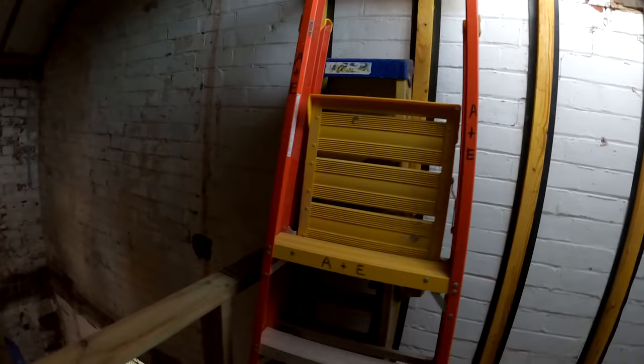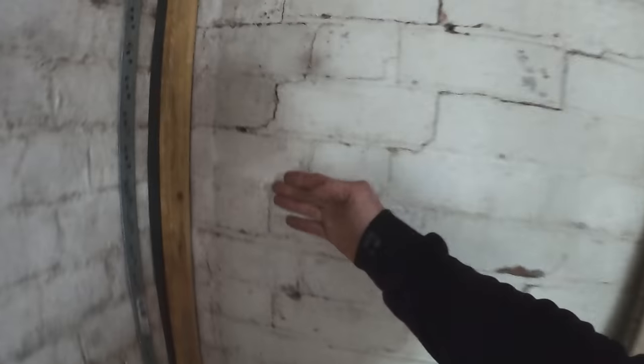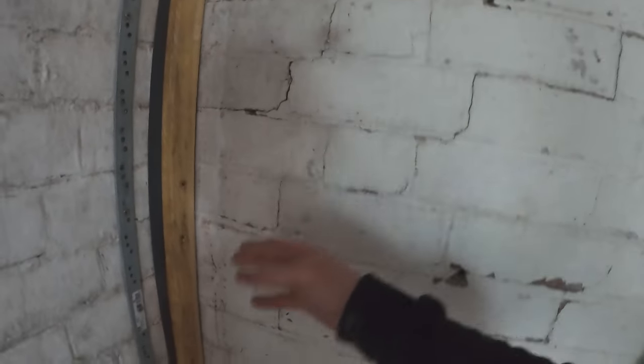And then we can put our foil back insulation board on there. This room's done. We're not gonna do that wall yet. Because we're using those discs, what it's gonna do is actually stand off the wall. By the time we've got our batten and our disc and then our insulated board, it's obviously gonna affect where we're gonna set our first batten.